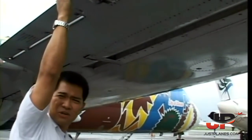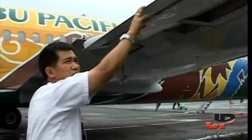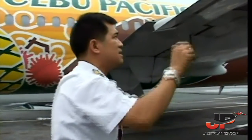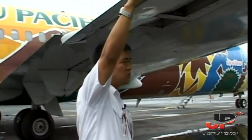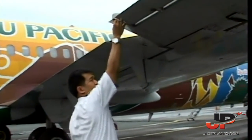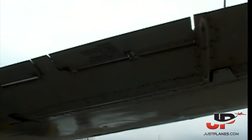Ailerons. Okay. DC-9 is not hydraulically powered with respect to the ailerons flight controls. The inboard ones are the control tabs. These are the trim tabs. When the pilot uses the yoke, left and right, it's actually the control tab that moves. Okay. The control tab goes up and the aileron goes down. The ailerons are bus connected, so if I push this up, the other aileron is supposed to move down. These are the trim tabs. Only wire cables, man. First generation fly-by-wire. Flaps. Go all the way down to flaps 50.